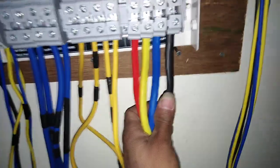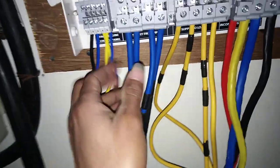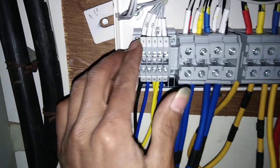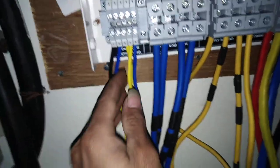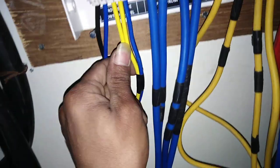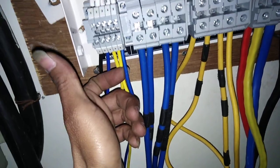I am now at the AMF panel board. I have connected all wires — this is the genset incoming wire and this is the output of the whole AMF panel, and the incoming of mains. I already showed you that five ports are taken from the AMF panel to the genset: 2D, 1D, GCR, MCR, and negative. 2D goes to genset port number 2, 1D goes to J2/11 auto start, GCR and MCR go from here on different wires but in the genset they are connected in one port, and the minus is the total negative given to genset port number 1.